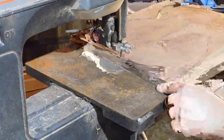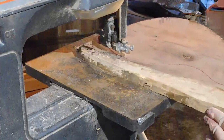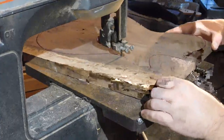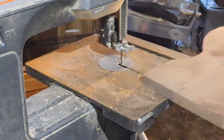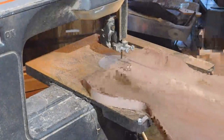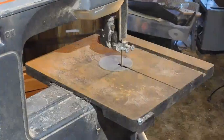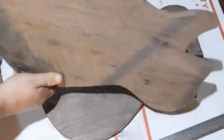That's my 12-inch Craftsman bandsaw. It does a pretty good job even on this hardwood — it's got about a half horsepower motor and cuts through it real good. What's really cool when you do this method is you can get one whole pass with no problems on each board, so it comes out with a really clean look. Sometimes when you do more than one pass on the router table, if your bit's not set up just right, there's a tendency for it to move and you don't get a clean edge. On this guitar I didn't have to do much edge sanding because of the way I routed it out.